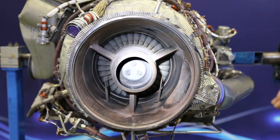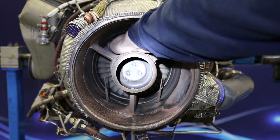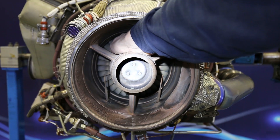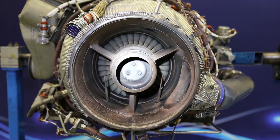What we're looking at here is the second stage turbine inside the exhaust housing. If I reach my hand in there I can actually rotate it in the normal direction of rotation — that normal speed of rotation is 48,800 RPM, so they spin incredibly fast. It's worth pointing out that many features and functions of this engine are very similar to what you'd find in a helicopter or turboprop engine. This falls under the category of a turbo shaft engine, and that shaft drives the aforementioned compressor and generator.